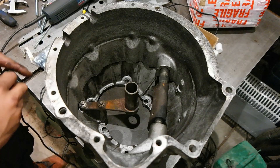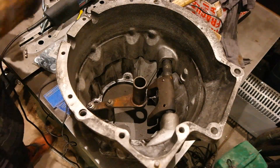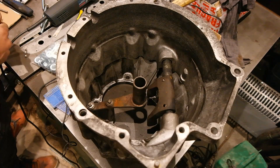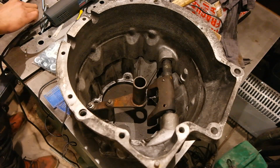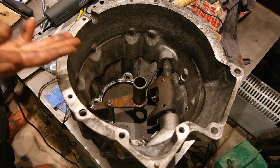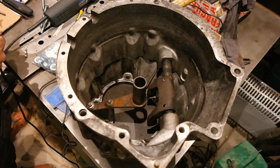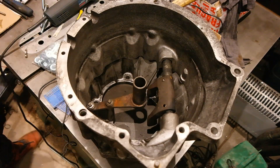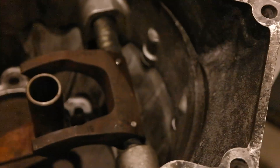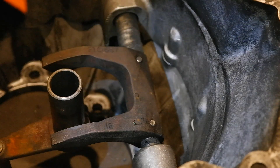Two hardened steel pins — that's one in and it was tight. Full disclosure: I'm putting a little bit of epoxy on these because after speaking to Mr ClutchFix he was pretty adamant that the standard pins just would not hold up and you have to use hardened steel pins. Now that I've got this P38 bell housing and it seems bigger than the pins ClutchFix thinks should be in there, I'm thinking somebody else drilled it out to put bigger pins in. These pins should definitely be strong enough anyways, but I just want to make sure they don't fall out, so the epoxy is just going to help that little bit as well. There are the two pins in — let's say a quick prayer we never have to take them out again, because I'm going to have to cut that shaft if I want them out.